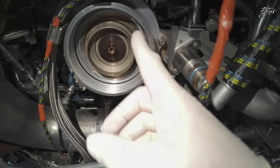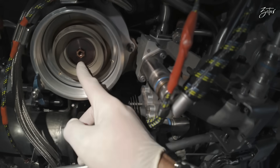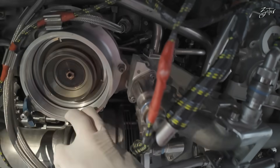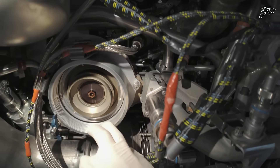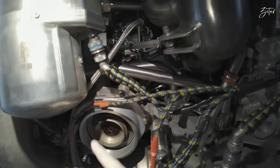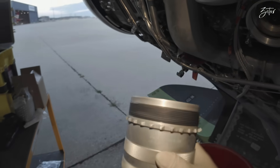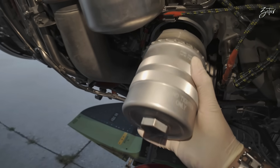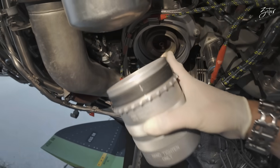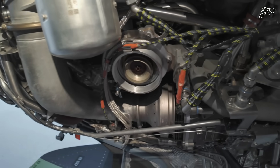The important thing is this check valve — whenever you push it, the fuel will start to flow out. So really follow the Maintenance Manual, which says: put the filter in the bowl and install it together, because if you put the filter in first and try to push it in, you will get a fuel leak.